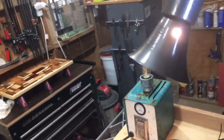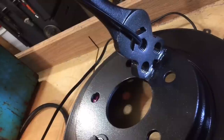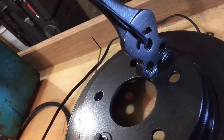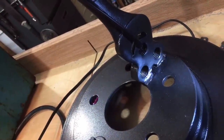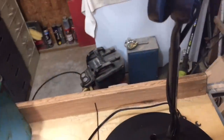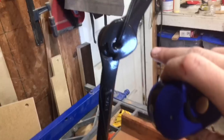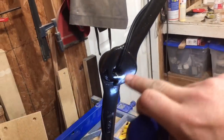My idea is to make all these joints articulate by using ratchets. I made one for Dan with his dad's old wrenches — it's still drying outside. My ideal design would be between this one and some features of that one. This whole thing was welded with the little Harbor Freight flux core welder, the cheapest one they sell. I preheated the rotor section because it's a little bit thicker metal, and I got some damn good welds out of it — I was surprised and pleased. The way I got these two pieces to join up is I welded two nuts together that actually fit the sockets, then loaded the sockets to the nuts.